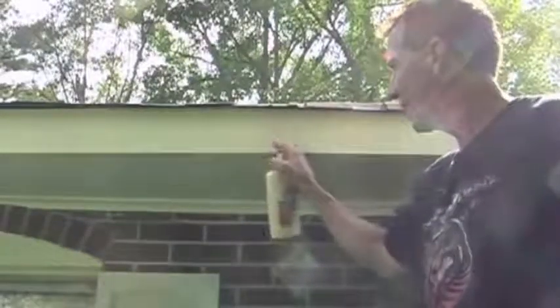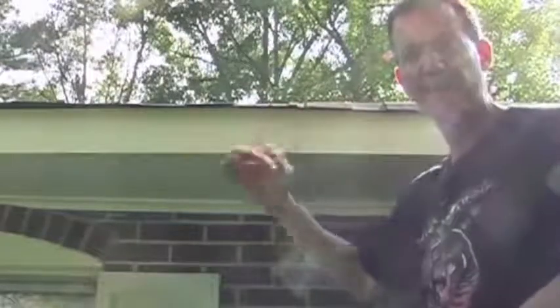You see this line right here? I left this on purpose so you can see where the seam is on this piece of fascia. This is the piece of fascia that we cut out earlier and I just used a circular saw to do it. You can see right here it's perfectly smooth. A couple of key things I do: I always put exterior wood glue on a seam before I put it together so it won't separate. I also take any little imperfections and fill them in with a little bit of Bondo, sand it, and now I have a perfectly smooth face.